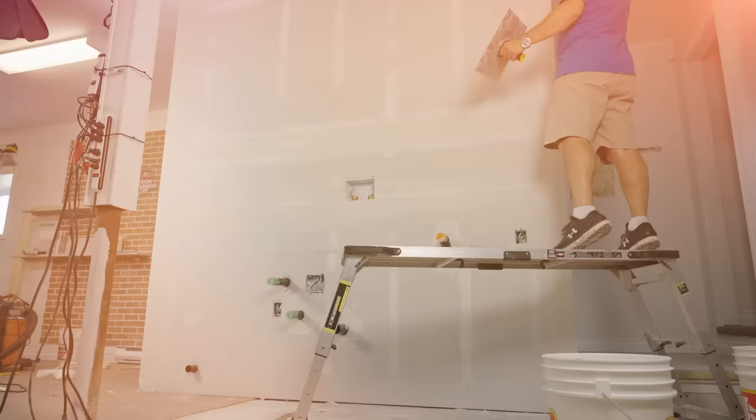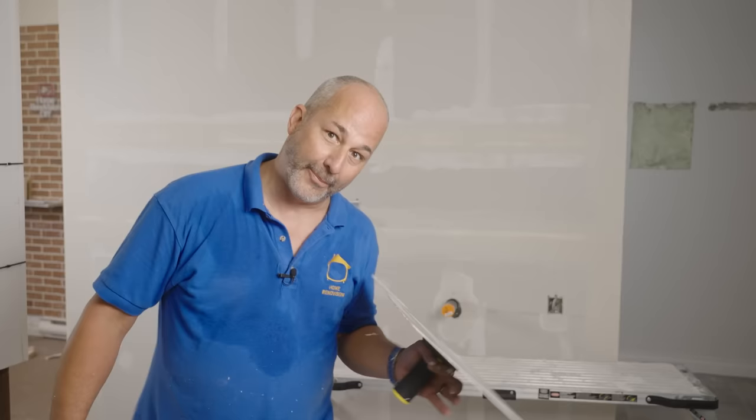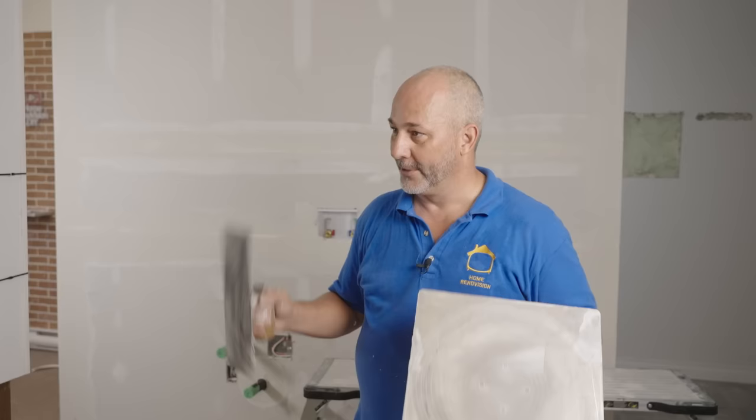All right. A little late, but lunch is here. It's 5-1. We're gonna throw the fans on full blast. By the time we're done eating, we're ready for third coat. We're gonna switch over to all-purpose compound for that coat. And then hopefully the fans will get that dry within the hour, and I'll switch over all my gear, get set up for painting. We should be able to start priming by 2 o'clock, 2:30.